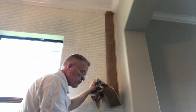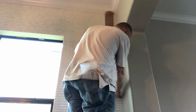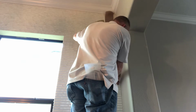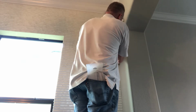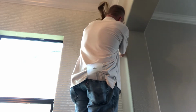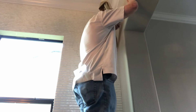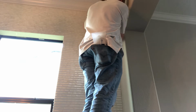You know, we have glue drying here. Look at how beautifully it's coming out, okay? I'm holding my finger right under the tape, 3 to 5 inches below. Keep moving your finger up. Hold that wall covering down. You don't want to pull it off the wall because then the beautiful seal that you're making is going to be now open. And you can't touch it again until it all dries so that you can try to fix it again. All right, so I'm just doing the same thing all the way up to the ceiling,